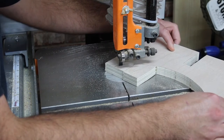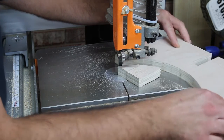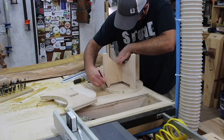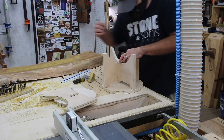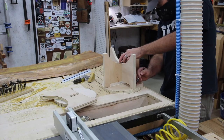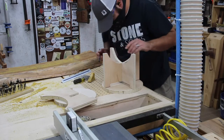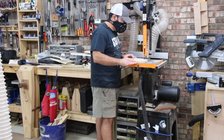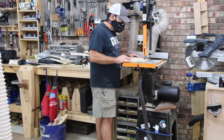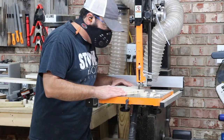Here's the second piece — I'm cutting out the bottom arch, and because I've transferred the layout, they should match up when they go together without any inconsistencies. After I get that all cut out, I'm going to put it together and draw out where the legs meet the top. That's honestly the best way to measure. I have plans with measurements, but for accuracy I recommend putting the legs together and drawing out where the through tenons will go through the top.